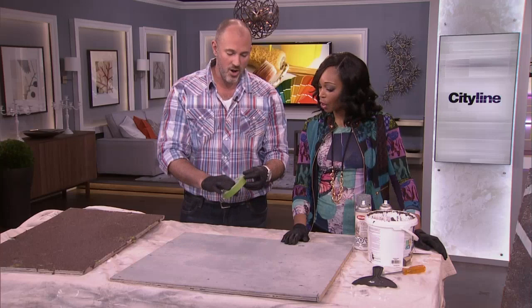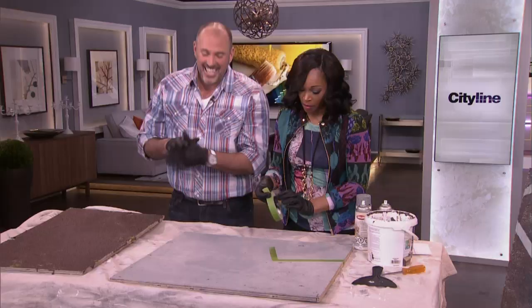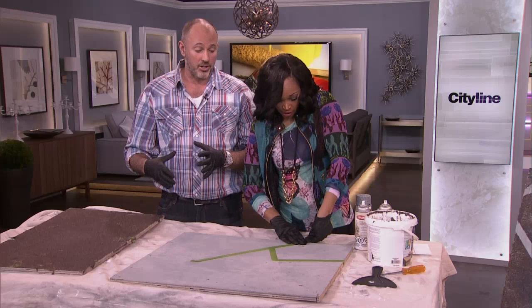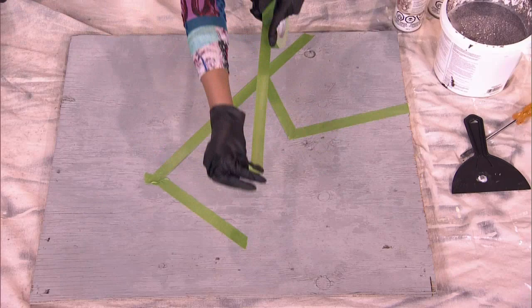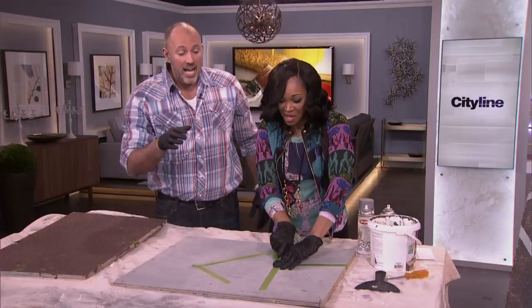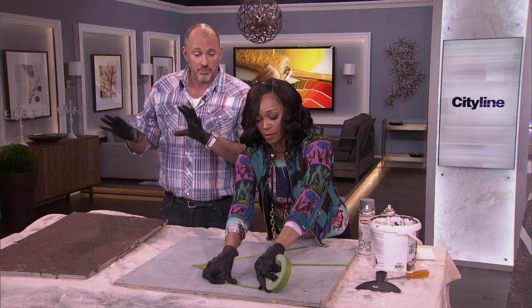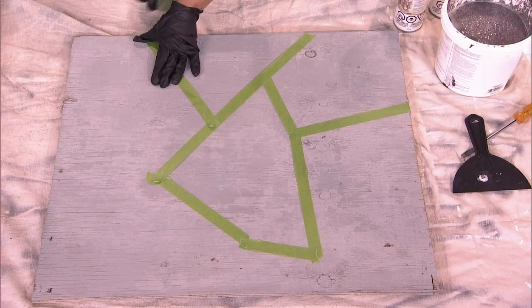Stone is not smooth, it's rough. Then we're going to make flagstone — you can have fun with this, you can make it zigzag. While you're doing it, I'm going to point out a couple of ways you shouldn't do it. Stones very rarely come in squares, so always aim for at least three or five sides to your stone. As you're laying it out, not only are you making the space on each side of the tape, but you're looking at the whole pattern you're creating — you're trying never to have perfect straight lines. Another use for this is along the bottom of the house on your flashing, on the concrete parging. I saw somebody do this underneath stucco and it looked amazing.